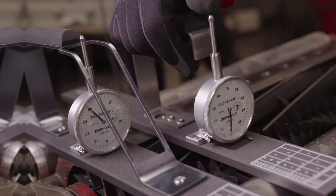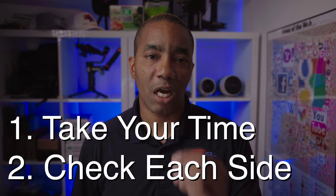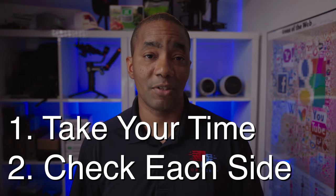As is also true when it comes to mower height of cut, it's good practice to periodically check the groomer height to ensure that it hasn't shifted. For homeowners, this typically means after every eight hours or so of mowing. The most important point to keep in mind when setting up your groomer is to take your time and get measurements on both sides of the groomer to ensure they have the same setting. By far, this is the biggest contributor to getting the best possible cut.